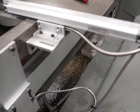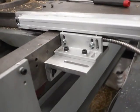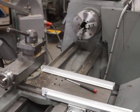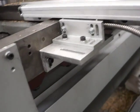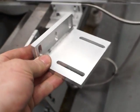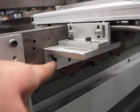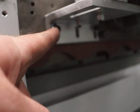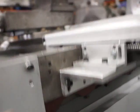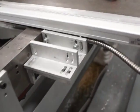This is showing you an alternative way to fasten on the X-axis on a Triumph, Master, or Student lathe. With this particular method, there are actually two brackets involved to attach the reader head to the saddle. You can see here we've got a normal bracket supplied — in this case fastened to the carriage underneath with two screws drilled and tapped into the carriage itself. It doesn't pick up on any existing holes; you have to drill and tap them.